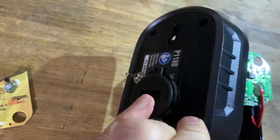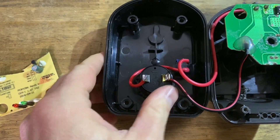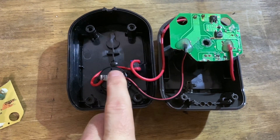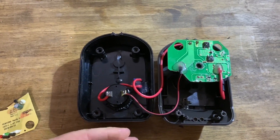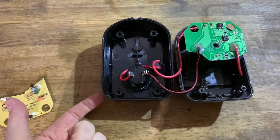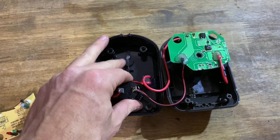So you get these USB chargers — that's the guy itself right there. That's the charger that you plug the USBs into. You get those on Amazon; I'll throw a link in the description. I don't have any affiliate stuff. Basically, what you need to care about is one that's rated from 12 to 24 volts DC input across its terminals. Some commercial vehicles — like aircraft or a lot of large trucks — run 24 volt systems. So it has a regulator inside to take anything in its voltage range and make 5 volts USB output. So there's voltage regulation built in, and that's the key: get one that's rated up to 24 volts input.